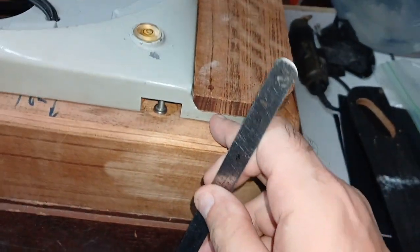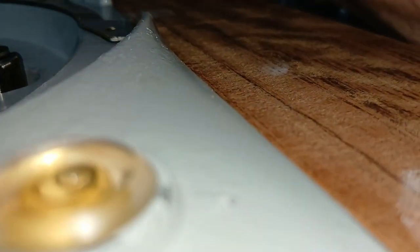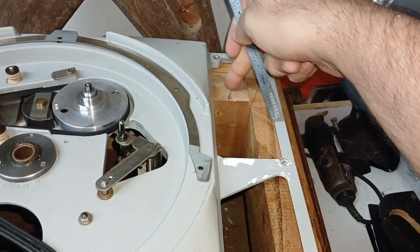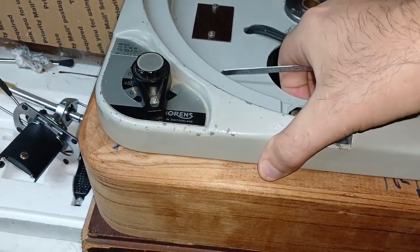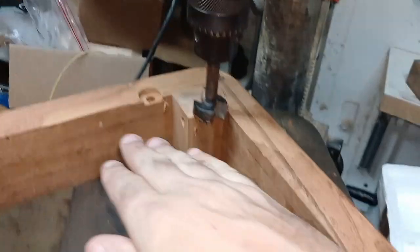This chassis itself is about 3/8 of an inch, and this panel is about, how much is that? Is about 1/2 inch, right? So we got this is measuring just under an inch here. So this is measuring just under an inch there, and this measures just under 2 inches, right? I need to go drill downward and to this left just about an inch, right? It's really similar to what I did in this opposite corner here. I've set up my drill press so it will go down about 1 1/8 inches from this top edge. So all the drill strokes I do will end up at the same bottom level.